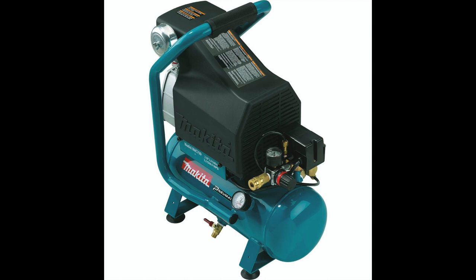The point is it's a very good quality, reliable compressor. It fills the tank very fast. It's got two horsepower, which is a big motor for a tank this size. If you're doing heavy-duty framing or need more air storage, you can always get a piggy tank and attach it.